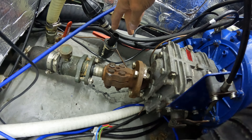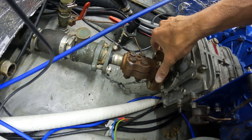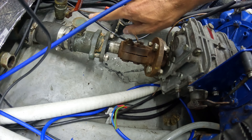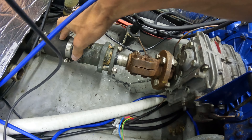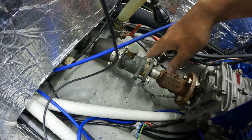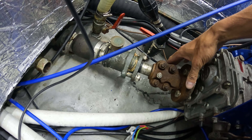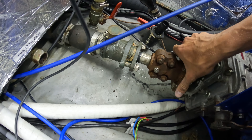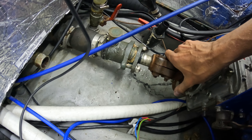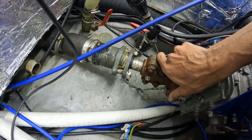The prop shaft is attached to the gearbox with this coupling, so I need to take that off so I can take the prop shaft out, so I can then take apart the stern gland and replace this tubing which is very spongy, very soft — so I think it's due for replacement. We were thinking about replacing it with the dripless seal shaft. I guess I should just start undoing bolts. I'll start with this bolt that goes through the prop shaft. These rusty bolts are going to potentially be really stubborn. This should really be painted to stop it rusting because this is mild steel or iron.